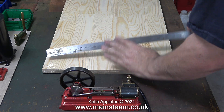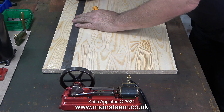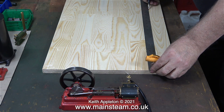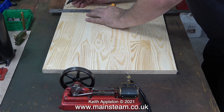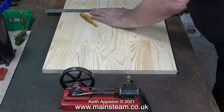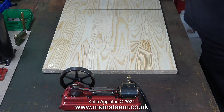I bought this piece of board from our local B&Q, which is like a big supermarket that sells things for DIY. I didn't want to use MDF or chipboard or anything horrible, so I bought a proper piece of wood. In this clip I'm measuring and marking the position where I'm going to cut the board. The board is going to be 17 and a half inches wide including the edging, and 16 and a half inches deep, and that also includes the edging.